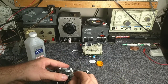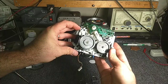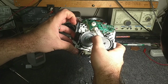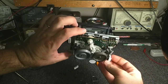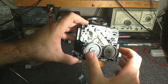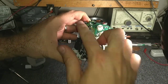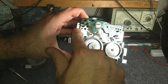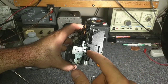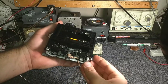Let's do a quick sweep at the flywheel. Push on the tab and rotate - that's play, and that should be stopped. When it's stuck in play mode, there's a piece that comes down to prevent the latch from opening. So you press the tab, cycle it, and now it opens. That's why it doesn't open while in play mode.